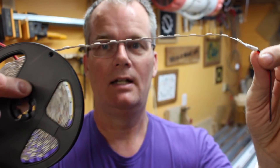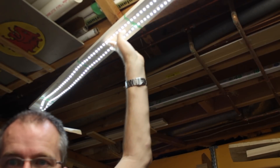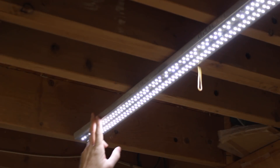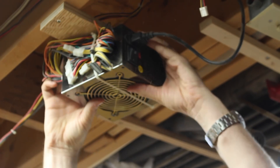I've got another DIY LED strip lighting project on the go. I've experimented with these LED strip lights before — the first time I was just curious whether they were even bright enough to use as regular room lighting, and they are. Then the next time I got the idea to use a steel stud for mounting them, which helps dissipate heat and gives a nice cheap mounting bracket. I also used a PC power supply to provide the voltage I needed, and that was free because it's a surplus power supply.